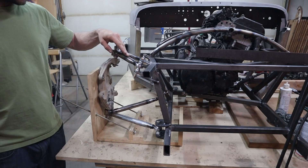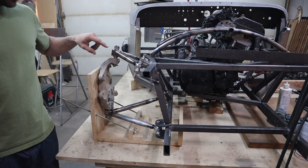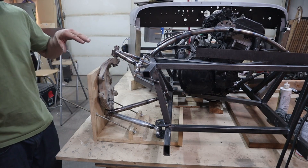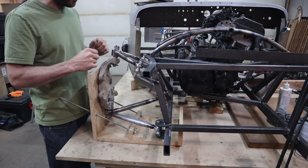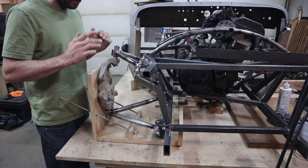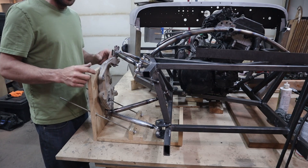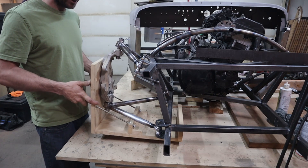This is one-inch DOM with chromoly ends — just didn't splurge for the chromoly on the tube itself. They seem to weld up fairly nice and everything was TIG welded with multiple tack-ups and lots and lots of trimming, just shaving off a little tiny bit. Here's the first side.